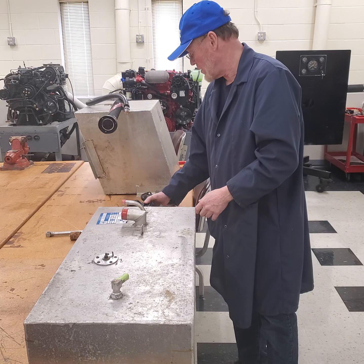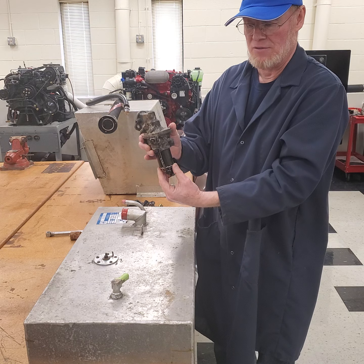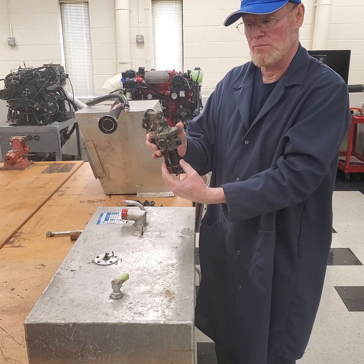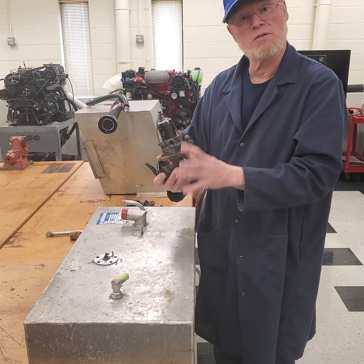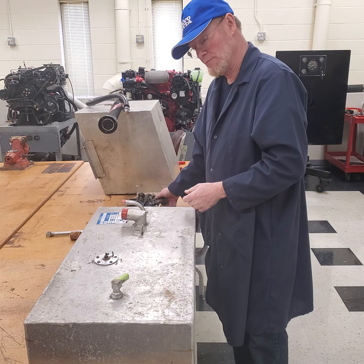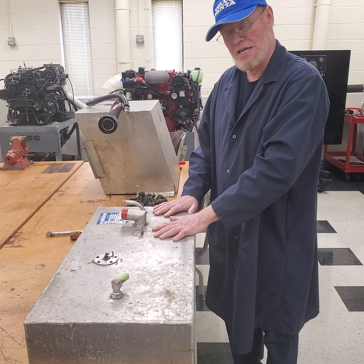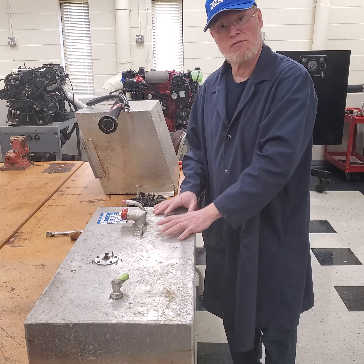You may also have an older style fuel pump that has a filter built into the housing, so you could loosen this up, take it out, and there'll be a filter in there. Some of these will actually mount upside down on the engine depending on the manufacturer. That wraps up the basic introduction — if you have any questions, feel free to email me.